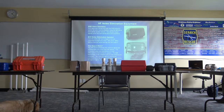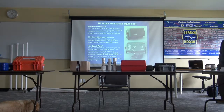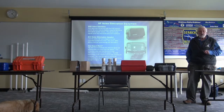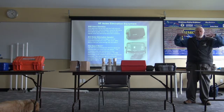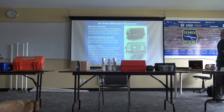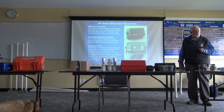They're made by a company called BHI out of England — we were dealers for them. I ran into them in Germany at an exposition and had a chance to test some of their equipment, and it's absolutely amazing. I bought one and I'm really, really pleased I did — on my ICOM IC-802 on the boat it makes a huge difference. It just gets the garbage out of the way and makes it clearer. HF is a noisy area — there's a lot of noise on it, and if you're in a marina, there's a lot of commercial noise available that can wipe out a signal.